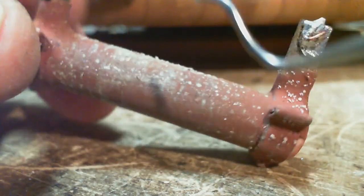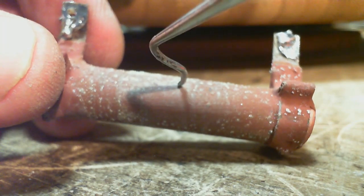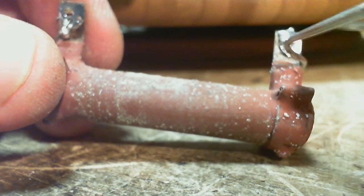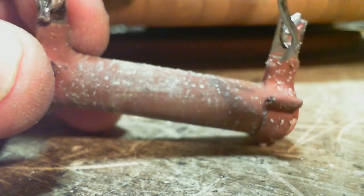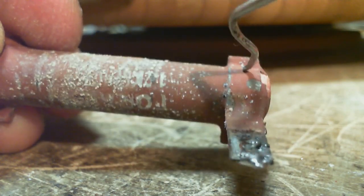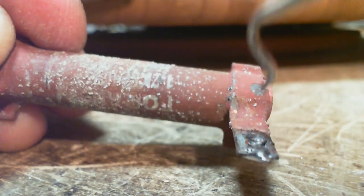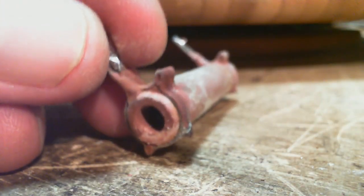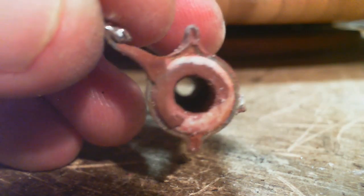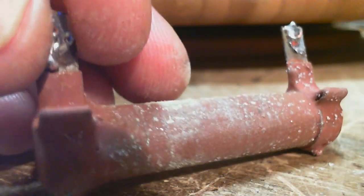We look at the actual terminals. Now, it's tricky. You got to take this wire in here and somehow connect it to these metal terminals out here. And that's usually done in a crimping, and it's probably inside this pinch point. Maybe not. Maybe they brought it up here. I don't see it. Generally, my understanding of these is that there's a mechanical clamping that goes on. Catch the end of the wire that's in here, and it's mechanical. It's under here. Then you heat the whole thing up and hope it's going to last until the year 2020. Oh, there's nothing inside. That's the problem. Well, open circuit it is.